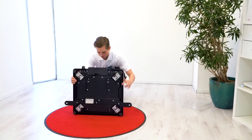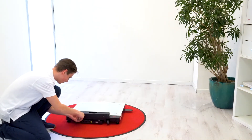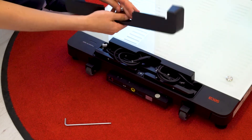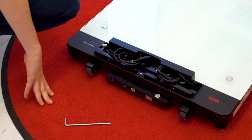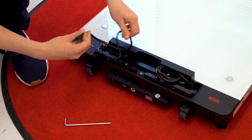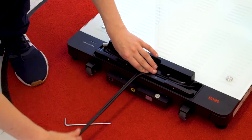Carefully flip the scale right side up. Remove the column socket cover with a 4mm Allen wrench. Put aside the cover and associated screws for later reassembly. Beneath the cover, identify the two BIA foot electrode cables and place both cables through the cutout.